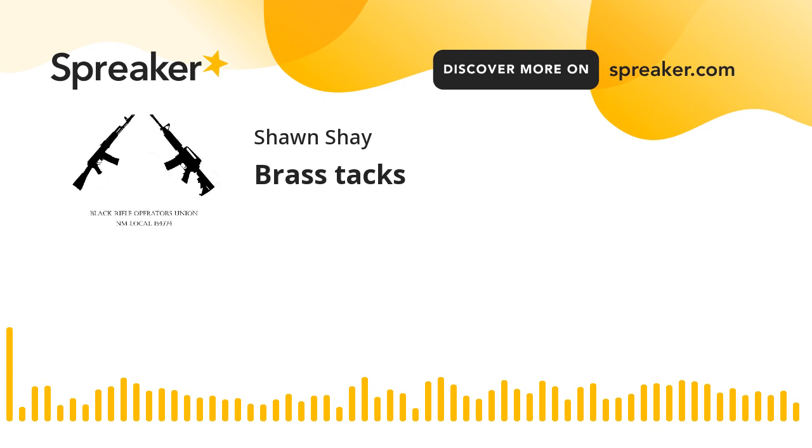If you're doing Berdan priming, you're going to need special loading equipment. They do make Berdan de-priming tools that thread into your decapper and pop the Berdan primers. But this introduces another problem: Berdan primers are not a thing in the United States. The real difference is how they flash — instead of two flash holes with Berdan, boxer-primed brass — which is what American and most Western countries use nowadays — has a single flash hole. There are still some European countries that use Berdan because they see it as providing better ignition for the charge.